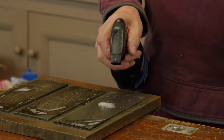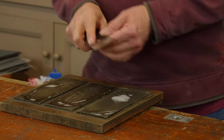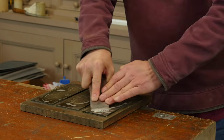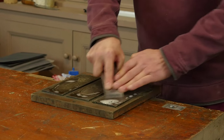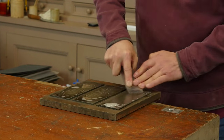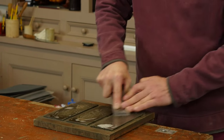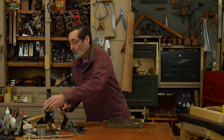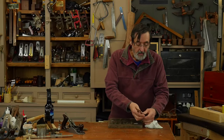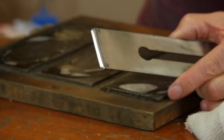Don't hesitate to come in with a little bit more moisture just to take the swarf off the surface. It keeps the cutting edge and the cutting surface of the plate clear from swarf and stops the build-up and clogging.